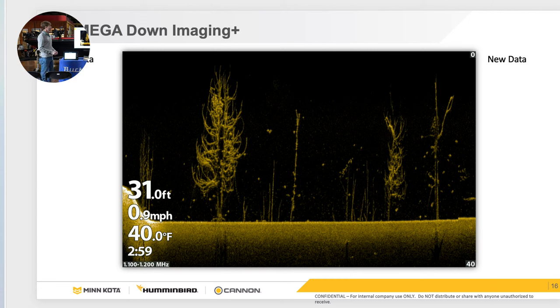For down imaging, this is the same thing showing straight down underneath the water column as side imaging. Data moves from right to left, so your new data is on the far right. Everything under zero is straight down underneath you; everything else is past history. Helix and Solix/Apex can actually scroll back — it records data for a pretty good while. With Helix, once it goes past the screen you have to redo it or mark it; Solix and Apex can record that data.